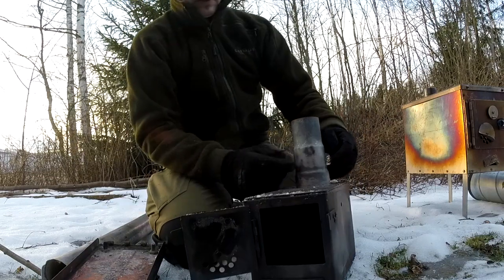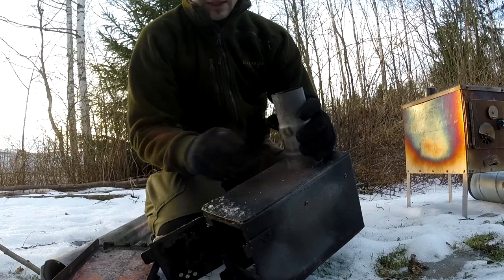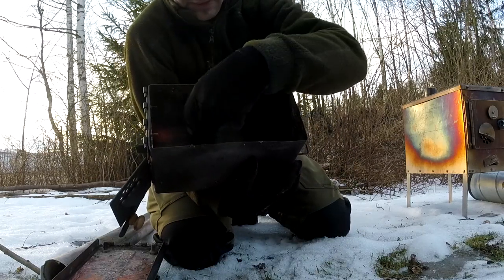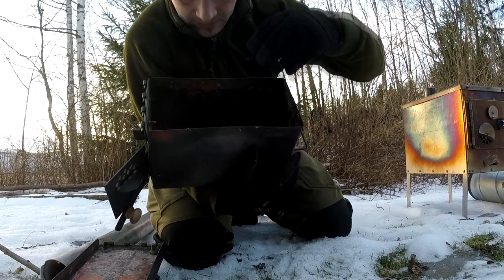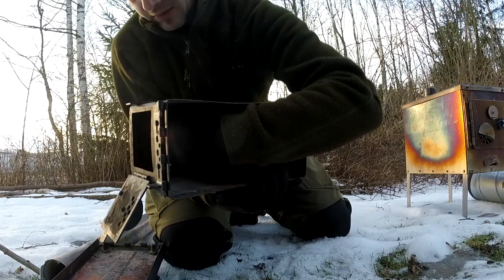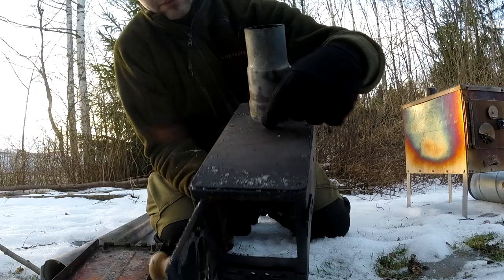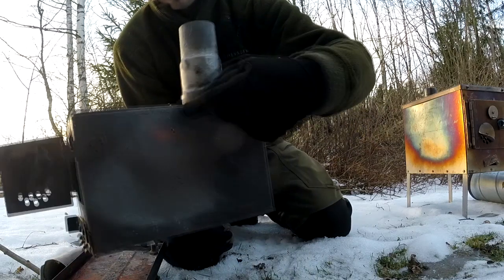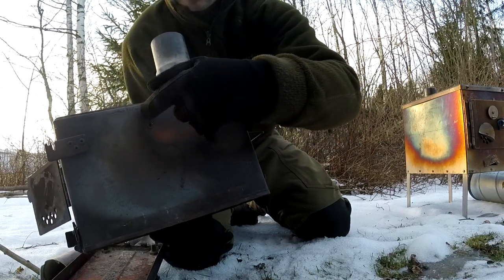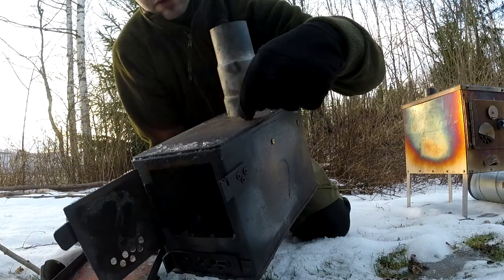The warm air and smoke will go up. This plate has a dual function — instead of having flames here or there or anywhere, all the heat has to rise, hit this plate, go around it, and up. That creates a really good cooking area because all the flames are directed around the plate.